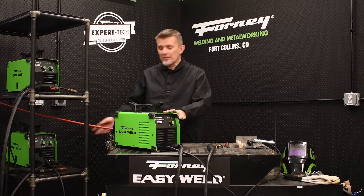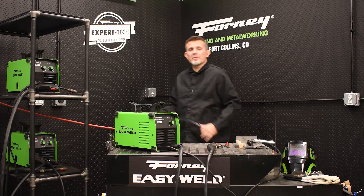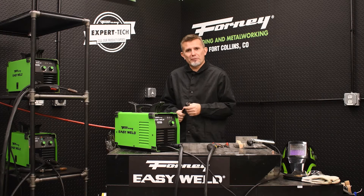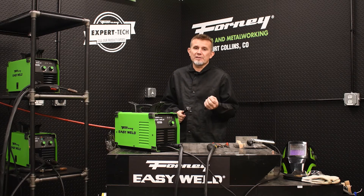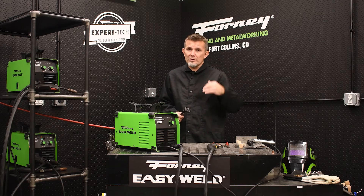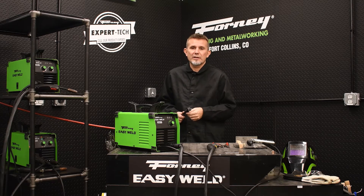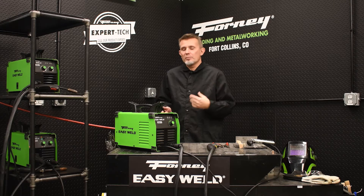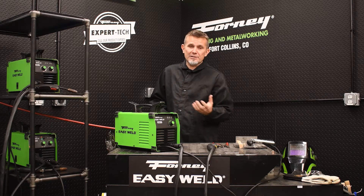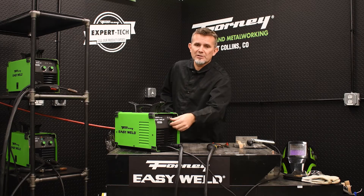So with the 20P, we have air coming into it, and now we're ready to plug it into the wall outlet. One of the things I get asked quite often is, can I use an extension cord with this machine? My first response is I prefer you not to. We don't recommend using extension cords. However, if you do need to use an extension cord, I recommend one that's no longer than 25 feet and it needs to be at least a 12-gauge extension cord. So 25 feet, 12-gauge, you can get by with it. But you're choking your input power to the machine, and you might have some performance degradation. When you're using an extension cord, I also recommend reducing your amperage just a little bit so that you're not drawing so much through your extension cord.